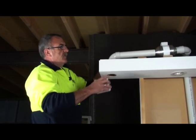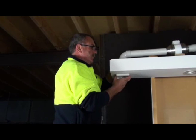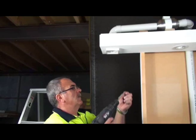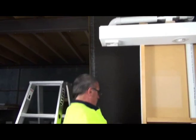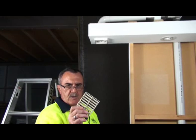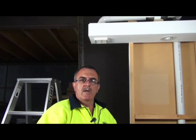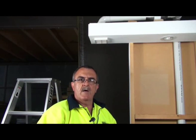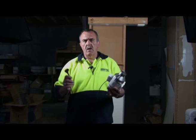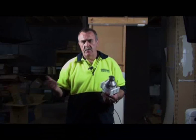After your fascias have already been installed, it's time to put in your exterior wall grill, which you just place up through the hole which would already be predetermined. Insert the pipe into the top, then just screw it to the fascias. Then click in the fascia of the outside exterior grill. And now we've completed the OVK1 system. All fans and motors come with their own electric lead and power plug, but all power supplies must be done by a licensed electrician for warranty purposes and your own safety.